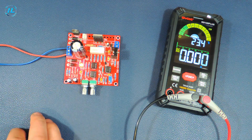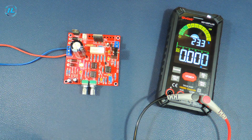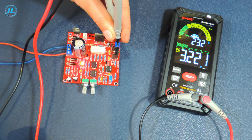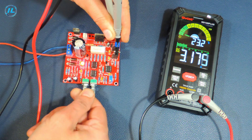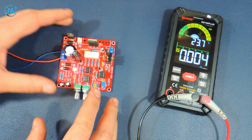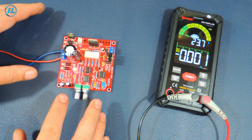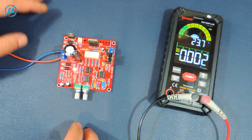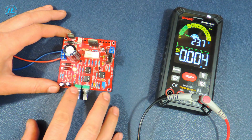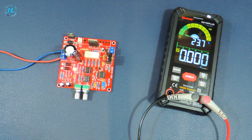When the voltage was applied, the LED immediately lit up signaling an overload. At the same time, neither the voltage nor the current were practically regulated. I repeatedly checked the correct installation of parts, checked all transistors, diodes, and capacitors, but to no avail. After that I bought 5 new TL081 operational amplifiers. After they were replaced there was no result — the power supply still did not work. In the end I gave up on it for a while.